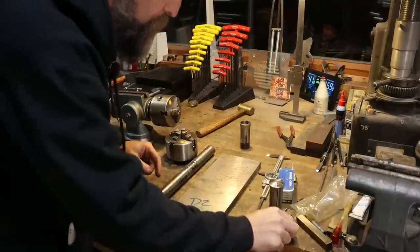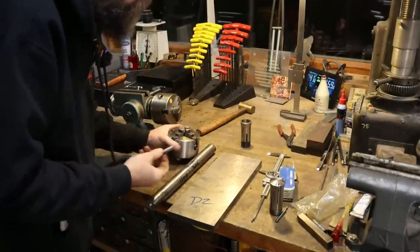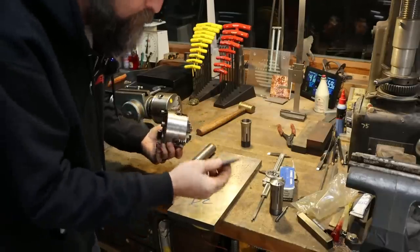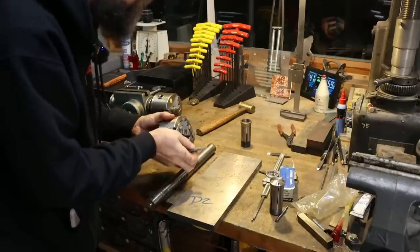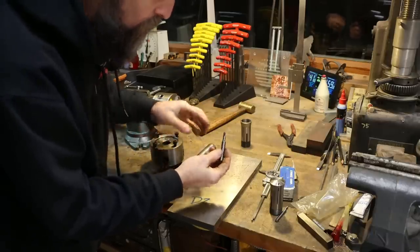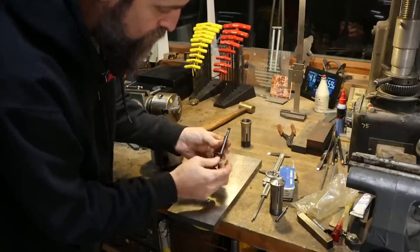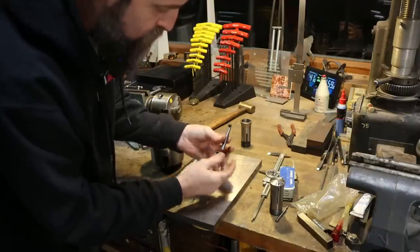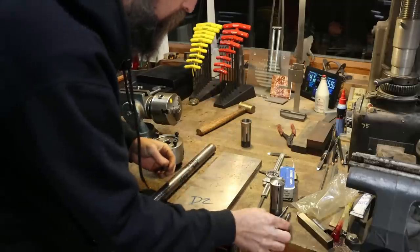All right, so here's an example of something that could be done, one of many things. If I can power this in my rotary workhead that I use on both my surface grinder and my cutter grinder, and that is offset grinds. You can see the neck of this small carbide boring bar, how that is offset. It's eccentric. One of many things that can be done.